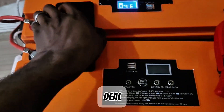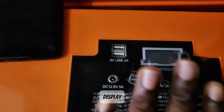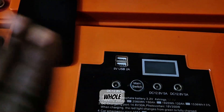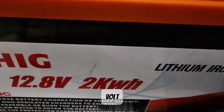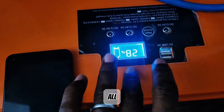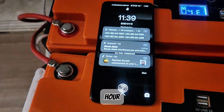I don't know how they did this. The inverter will go off shortly. This battery has dropped to 31% and the other has shut down — showing 0% — but the inverter is still on and giving output. The conclusion is that this battery is not up to its rated specs: 200 amps, 12 volts, 2 kilowatt-hours. I'm not sure they used the right cells. The second battery has now dropped to 27%, and the system has fully shut down after 1 hour and 9 minutes.